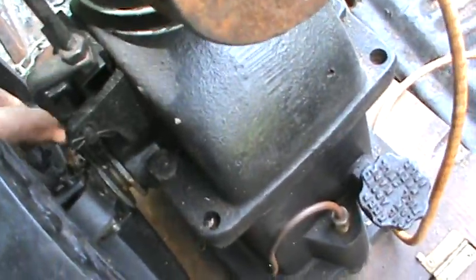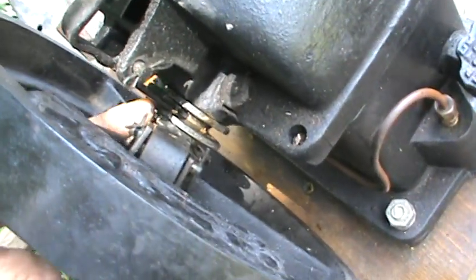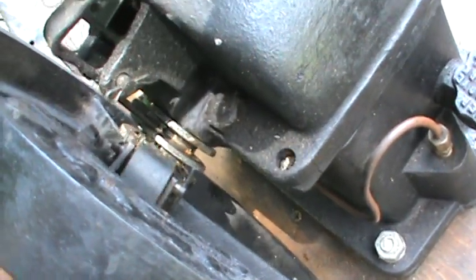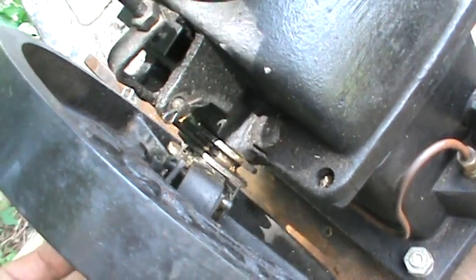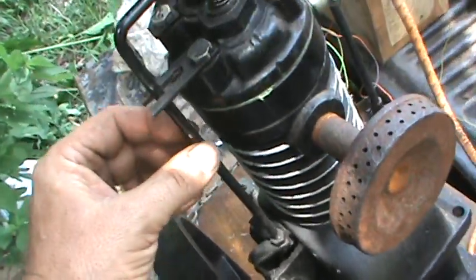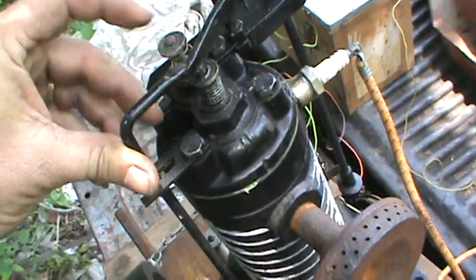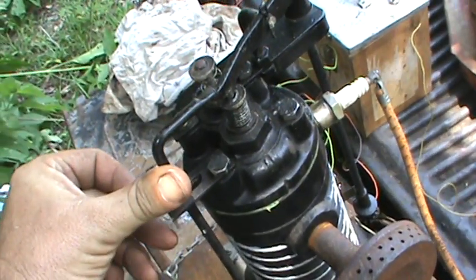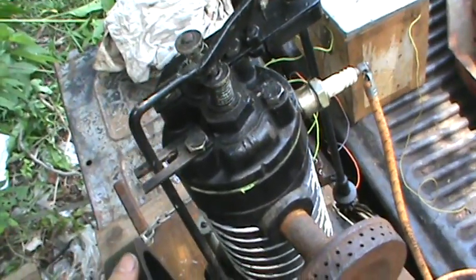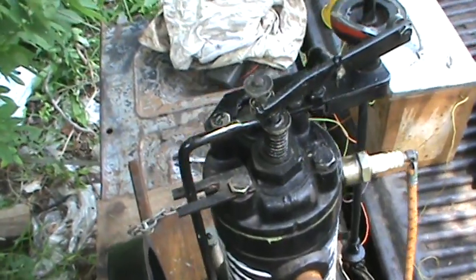I've made a collar, as you can see right here, that goes on the crank and slides back and forth. It works this little lever here, which comes up here. And when it's working, it will hold the exhaust valve in — that's how you get your hit-and-miss. When it comes around time, it will open it again and let it work freely just like it should.